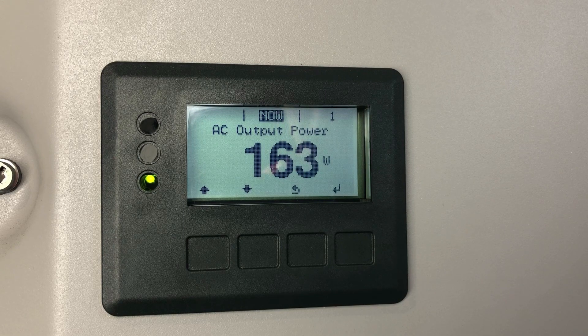The reason we set up your inverter to night mode is if you have a smart meter installed with the system, it keeps the inverter operational at nighttime so it can save the data from your smart meter and keep track of all your consumption at night time.